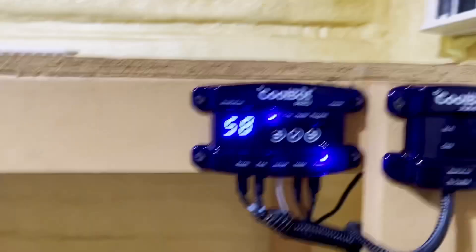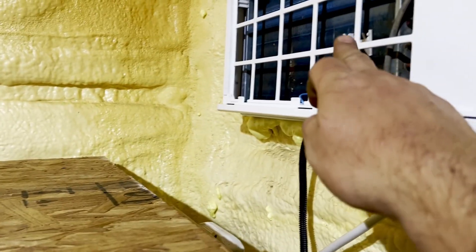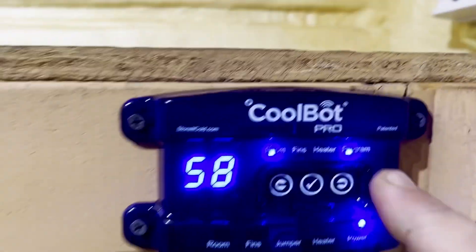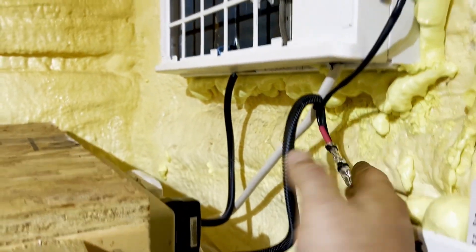But here's what it does. You take the thermocouple out of the fins here and then you wrap a heater wire around it. So if you ask this guy right here what the temperature is, that's its lowest setting. It thinks it's 99 degrees when really it's 58. So what the CoolBot is doing is heating up this thermostat wire, telling it, hey, it's not as cool in here as you think it is — so keep cooling.